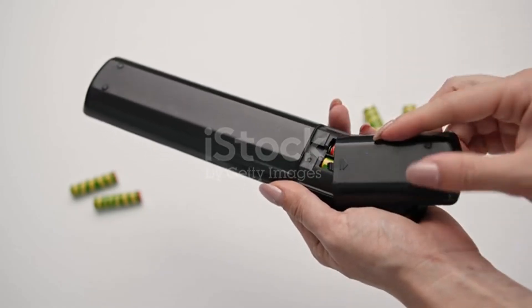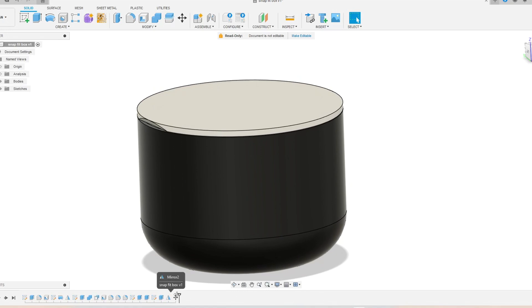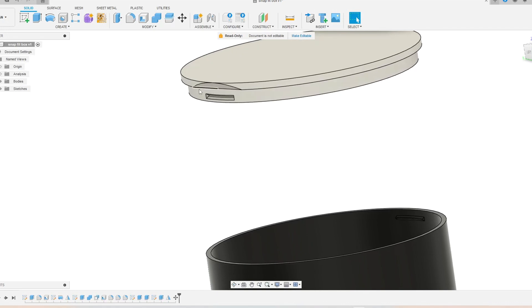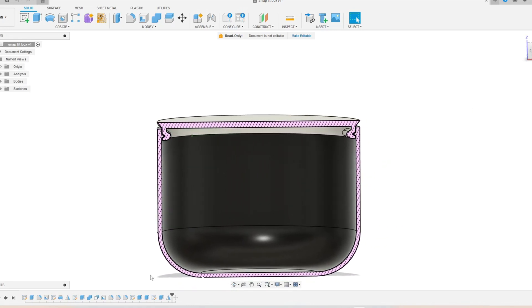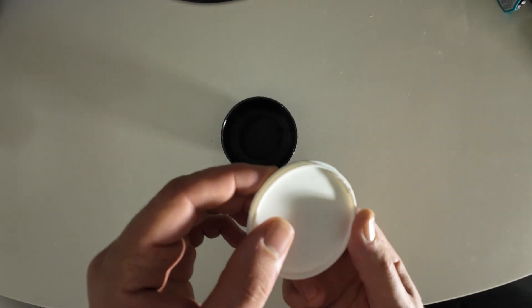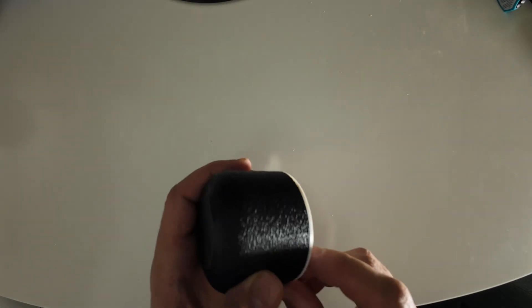You can use this lock mechanism in boxes, lamps, or other things. We can also use snap fit lock mechanism — there are many different kinds. You find snap fits in remote control boxes, locks, buckles, and many other things. I designed this snap fit lock from two different bodies: one is male and one is female on top, and there is a tab where you can put your finger to pull it up. After printing, you place the top and press it so it snaps with a click. To open, you just pull it up.